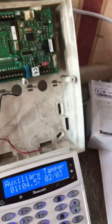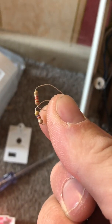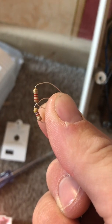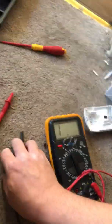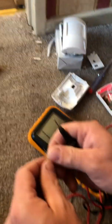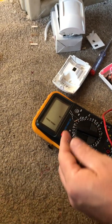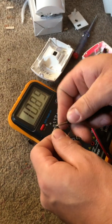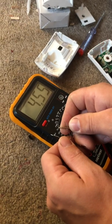The first thing you need to do is find the resistors. As you can see, there are two types of resistors here: the 2k2, which is the top one, and the 4k7, which is the bottom one. These are identified using a multimeter — put the probes across and as you can see on the meter it reads 2k2 for this one, and 4k7 for this one.